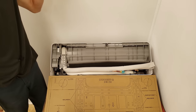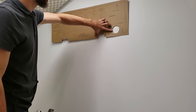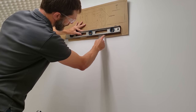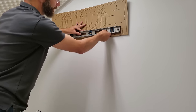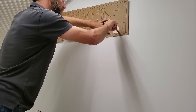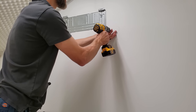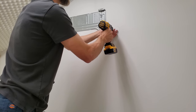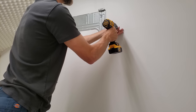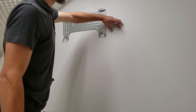From this tab — which is the middle of the metal — it's going to be about five and three-quarter inches to where all of this stuff is. So that's where we need to drill our hole. What we did now is we just cut the bottom of the cardboard pieces and you see where our hole is. I want to make sure that hole is not below the metal pieces, because that's where our mini-split indoor head unit snaps in. You can see our hole is not below that. I'm going to put my deck screw in just to see if there's any stud or anything else in the wall right there.